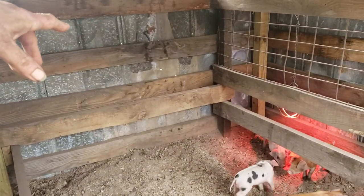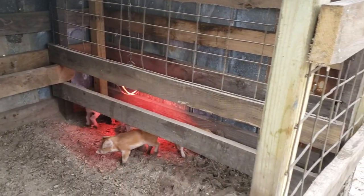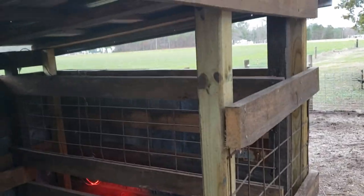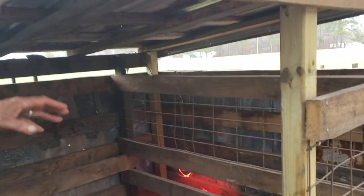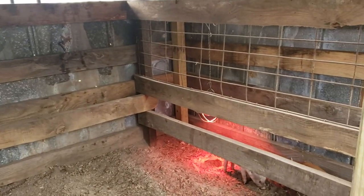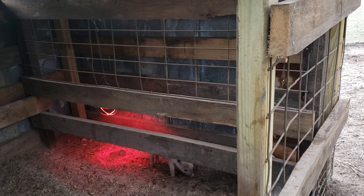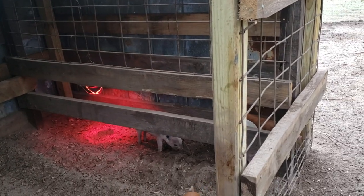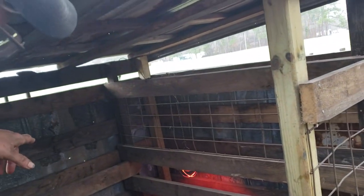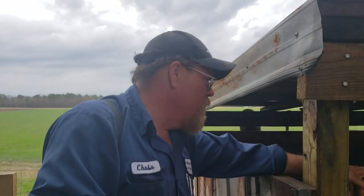You can see we did this one different — I put more boards inside. Everything here except the four-by-fours is rough cut lumber. You're going to have to do some kind of termite protection. I've discovered that as long as there are hogs in the pen the termites aren't a problem, but take the pigs out and they'll about destroy one of these shelters in three months. Check with a local exterminator — they have termite treatments that aren't dangerous for pigs that can be buried or sprayed around.